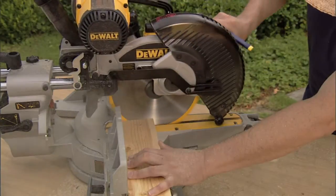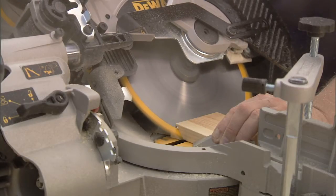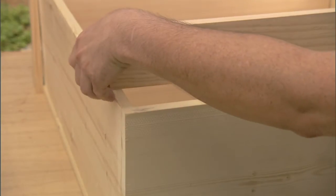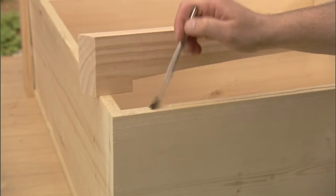This will sound very familiar to you. You cut it to length on the miter saw and then cut the 45-degree angles on each end. Test fit to make sure it lines up correctly, then go ahead and transfer the pattern and cut the arch out with the jigsaw. Then you can just attach it using glue and nails.